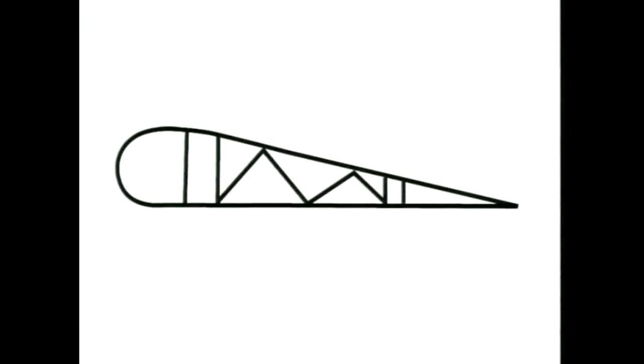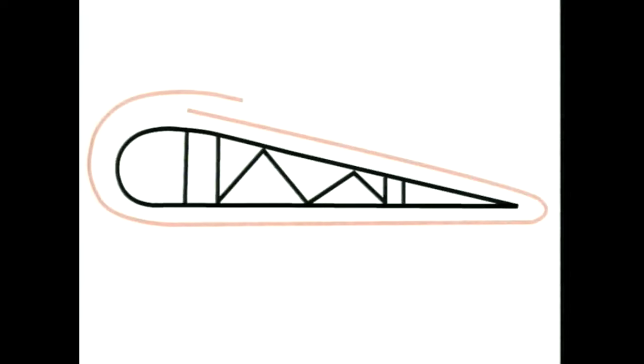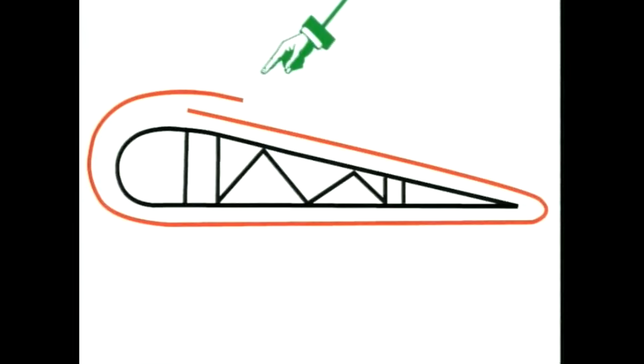On the new standard lower wing, you would want to cover the bottom of the wing first, so that the top piece of fabric is wrapped around and cemented to the bottom piece on the underneath side of the wing, where you can't see the final glued seam. On the tri-pacer, you would cement the top piece of fabric on the wing first, so the bottom piece could wrap around and be glued to the top piece on the top portion of the wing, where you won't see the final cemented seam. You can use a tape measure to determine how far up on top the seam could be taken, given the 70-inch maximum width of the fabric.